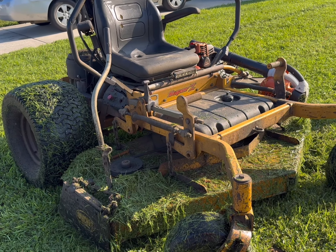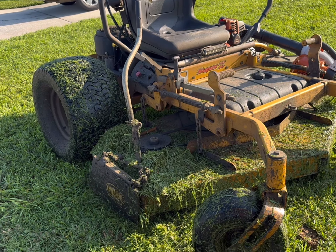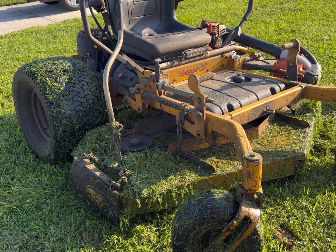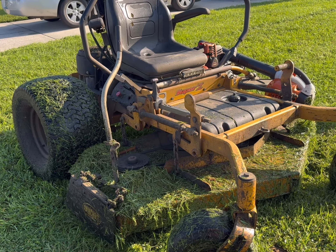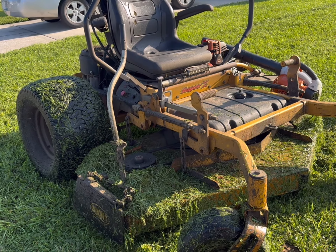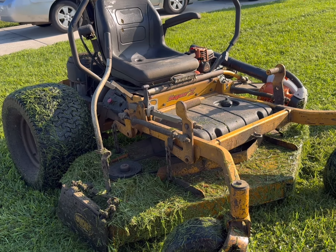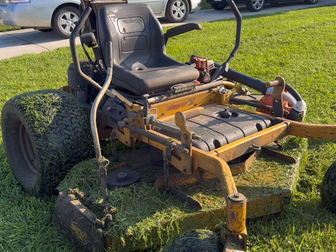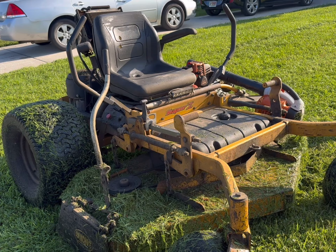Next I would learn that mower like nobody's business so that you know things that are wrong with it before the breakage. You can notice when there's a skip on the hydros and know if it's paired to both sides so it might be the belt — just little nuanced things you'll acclimate to when you're running the same machine.